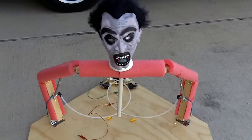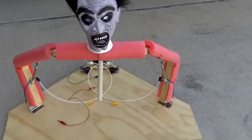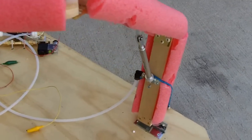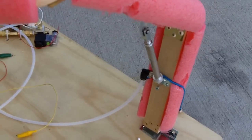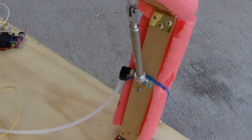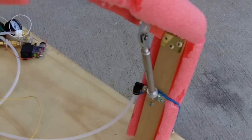I can get away with using a lot less PSI now, and I prefer that. Going on to the cylinder part: a lot of dual action cylinders require one for firing and one for retracting. I got these kind that have spring retraction, so I only need one hose going to each cylinder, and I think that simplifies the design quite a bit.